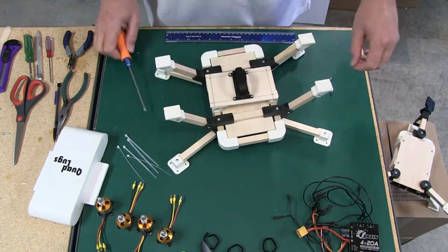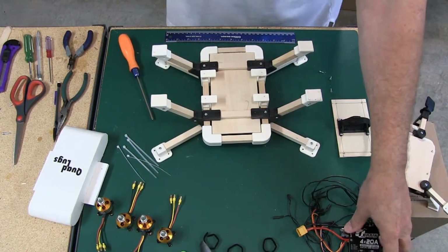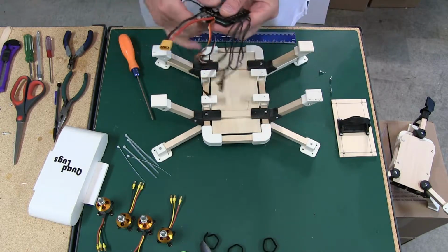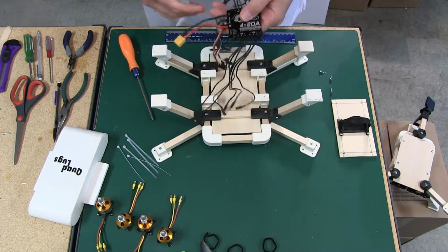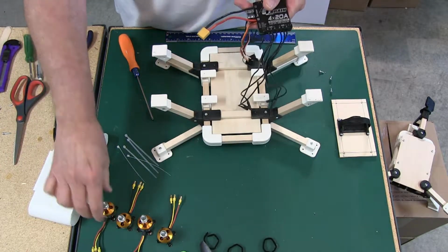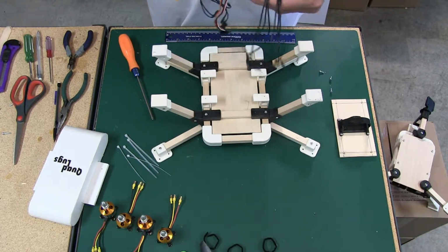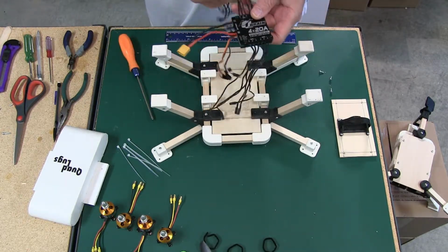Okay, we're ready to install our ESC. I'm using the Qbrain, and if you've been watching our videos, you know this is pretty much what we use exclusively. On this particular one, we're putting in a 20 amp, and I think these motors here are 221210 SUPO motors, and I think they're like 1400 kV. So we're going to go ahead and position it. And I am using 8x4 props, by the way, on that.